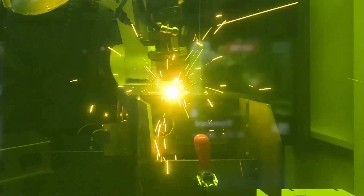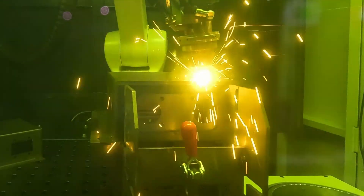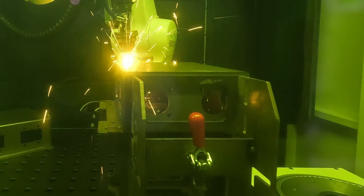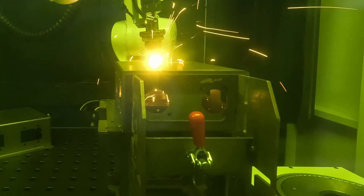So this is going to be using laser welding. We have a three kilowatt laser on here that can penetrate up to four and a half millimeters in stainless and mild steel, and three millimeters in aluminum. The beauty of laser welding is that it's five times faster than TIG welding and three times faster than MIG welding.